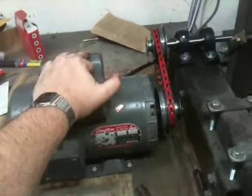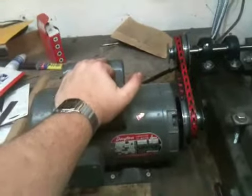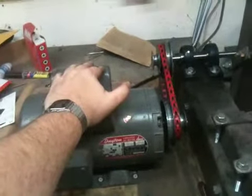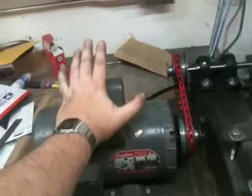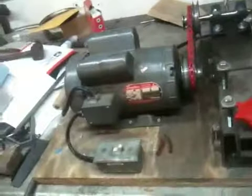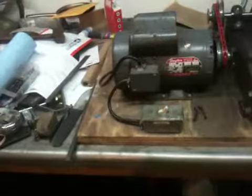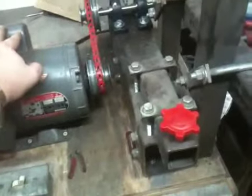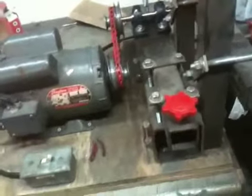me some issues. And just a quick note about that, as well as tool maintenance in general. It's almost always better to catch your problems early and fix them as soon as you notice them, because the smallest issue, such as a little bit of extra noise and vibration, can easily manifest itself in much bigger ways down the road. Parts can start vibrating loose, becoming weaker. You can add extra wear to various parts, such as the motor, various bearings, wheels, and things like that.